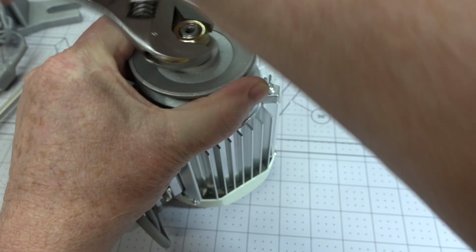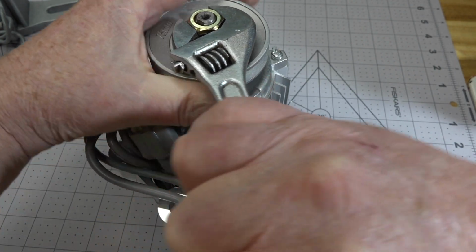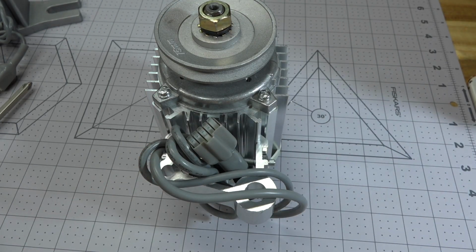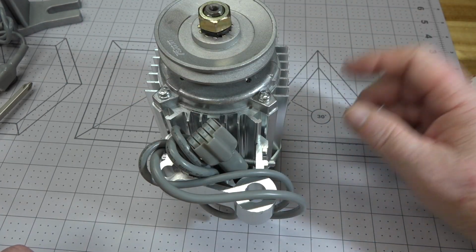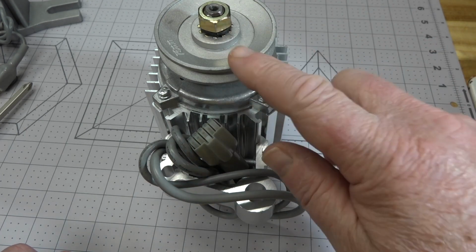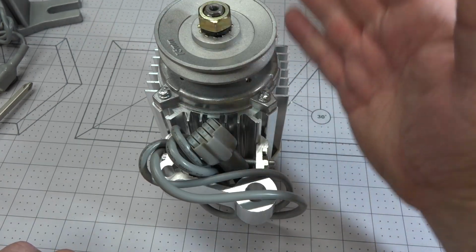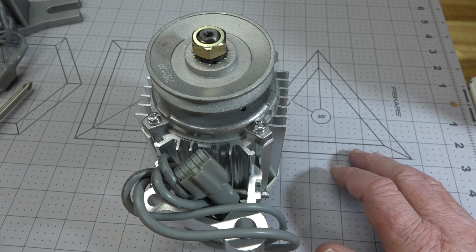If you're using a guard, this is the last step you're doing, because after you mount your pulley, by the time you mount your motor onto your table, then you can see where this guard goes. Once that happens, then you got to put your pulley on while it's on the table. And if you went to that extreme, naturally everything came off. Your keyway, your washer, your lock washer. So if you're keeping your guard, revert to this very first section, how to put it all back together again.